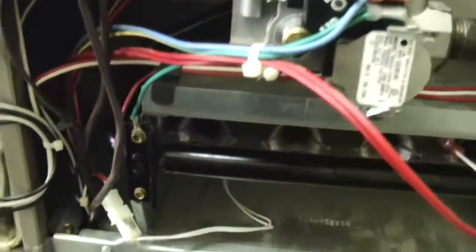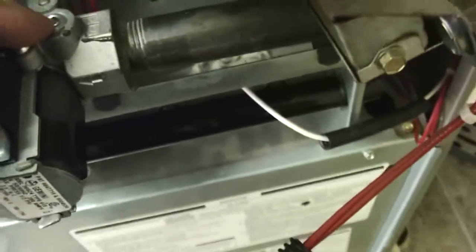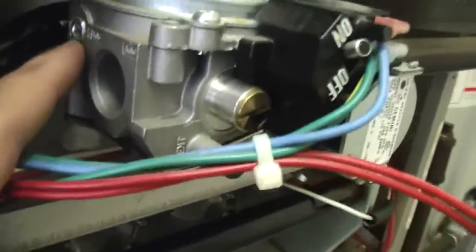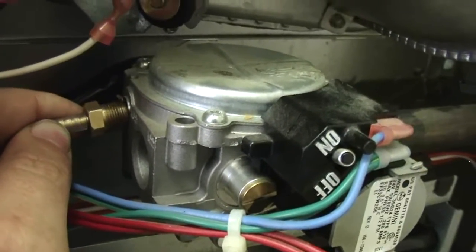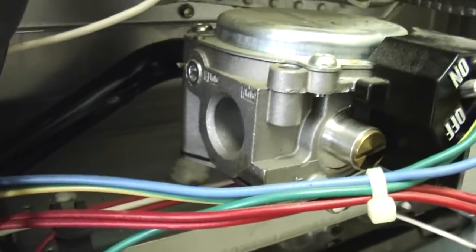I'm not sure if you know how to hook up for gas pressure testing, but I'm going to show you. The gas line coming in — you're going to have a little fitting here, that's going to be your inlet. Do not take that off, do not hook it up here. You can check inlet pressure, but make sure your gas valve or gas cock is turned off if you want to check inlet pressure. We're going to come out here on the manifold side, which says 'out' — we're going to take that little fitting off right there and hook this fitting to it. It just screws right in here, then we'll hook our plastic tubing to that, and that hooks to my meter.